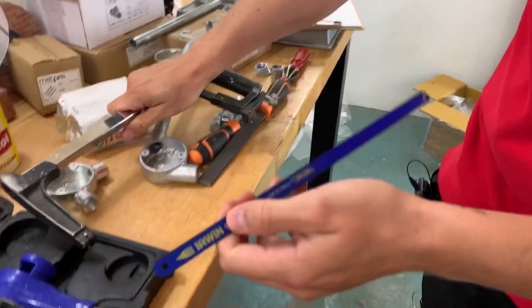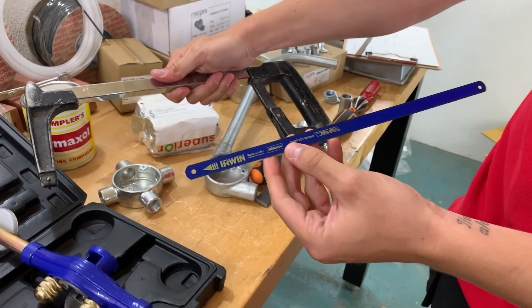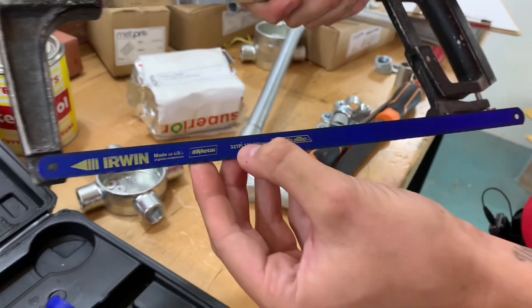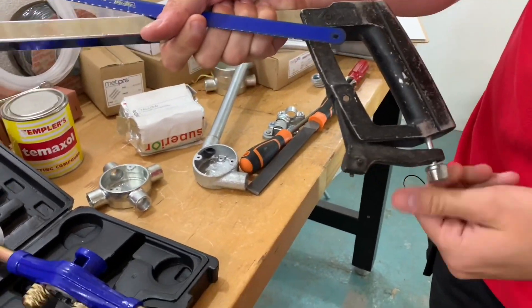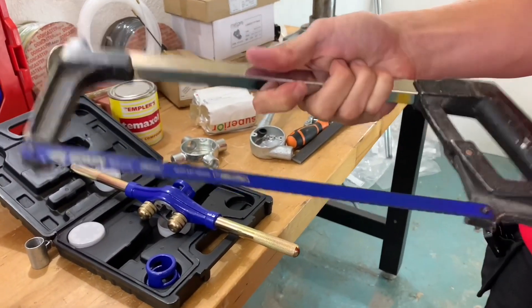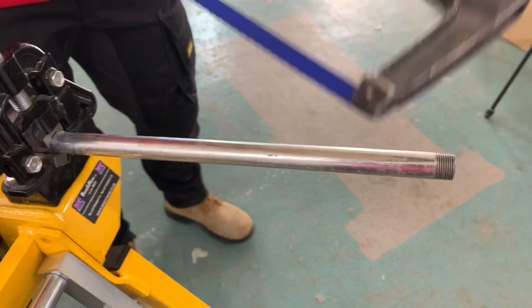So you've got a new one there to insert. Can you first of all show me which way round it needs to go? We're gonna have the arrow pointing away from us. There's a little arrow on the end there and it's important when you're training to make sure that goes on correctly. The number of TPI, or teeth per inch, is really important as well. We said what would be the minimum number of TPI we'd need — we want a minimum of 24 teeth per inch. It's 32 as you can see there. What's the thinking behind having lots of teeth when cutting metal? That's better at cutting harder materials. If I think about cutting wood, I've got a few big teeth, but when cutting something really hard I need lots of fine teeth. That is a bi-metal blade — we'd rather it be a high-speed steel one. If you're getting a hacksaw blade, get a high-speed steel one. We're just going to make a cut somewhere on our conduit in order to start the threading process.